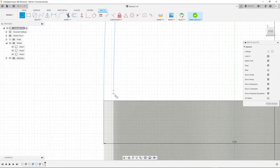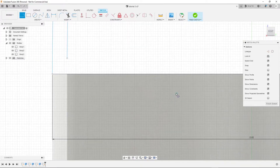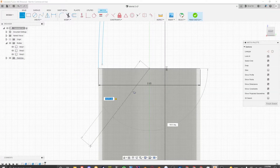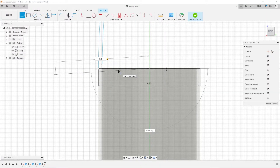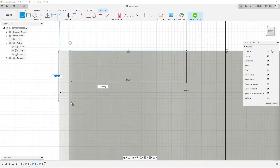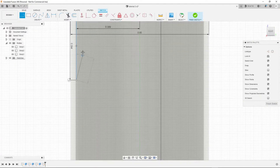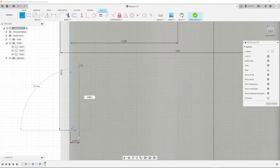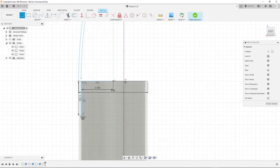This is going to be a tricky part. For how tight a fit, I usually go a quarter of a millimeter on both sides so an eighth of a millimeter. Set it to 9.875 millimeters — that will make a line just barely from the edge. Then go down one centimeter; this will be how tall the shoulder is. Then go 0.8 millimeters out and up one centimeter.